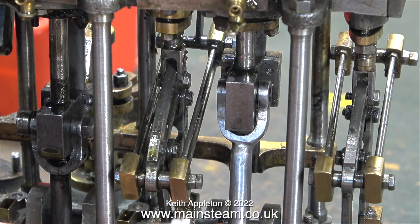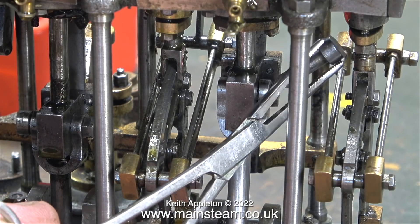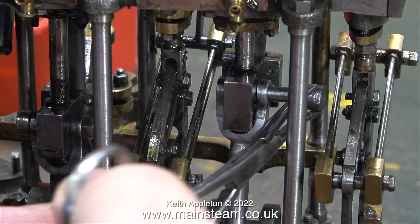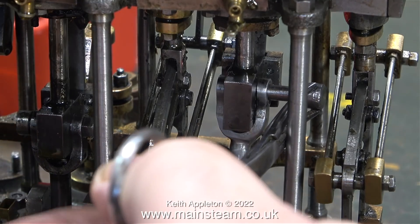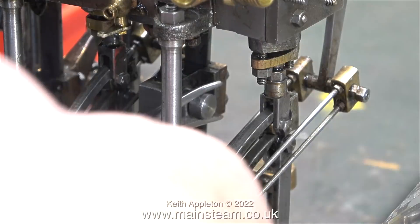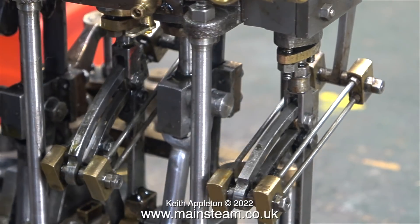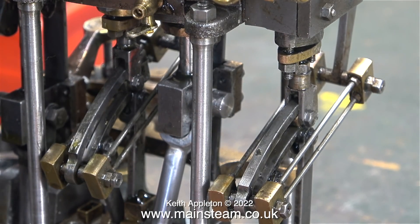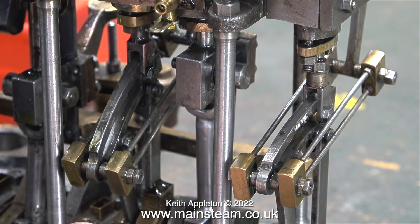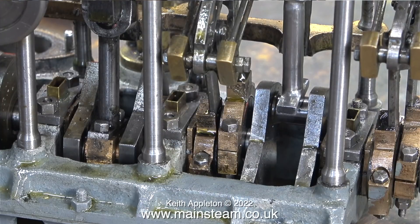When I looked at the positions of the bolt holes at the bottom part of the connecting rod, I was a bit concerned that when I put the engine back together the crosshead would not be in full alignment with the big end. In this clip I'm replacing the crosshead pin. These pins are quite a good fit in the connecting rod fork but a really sloppy fit in the crossheads. I intend to bush the crossheads with phosphor bronze.